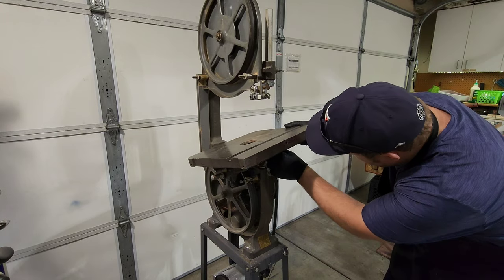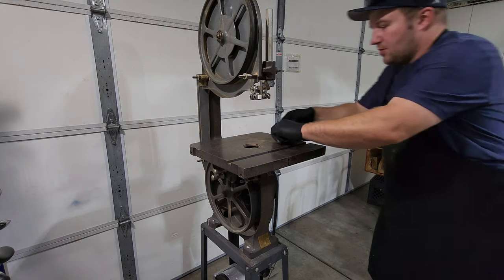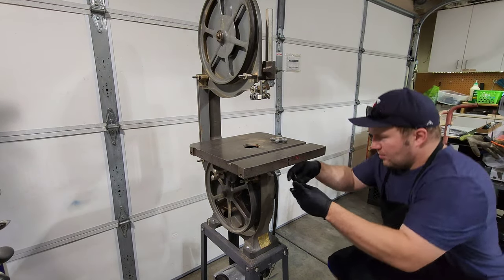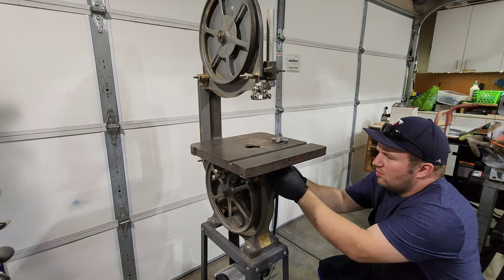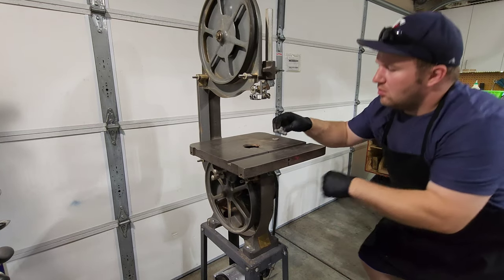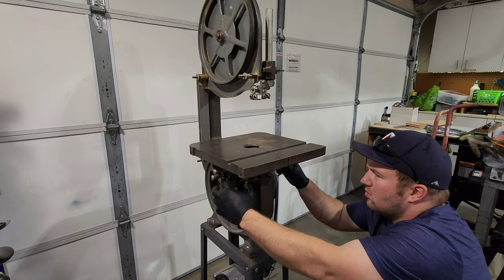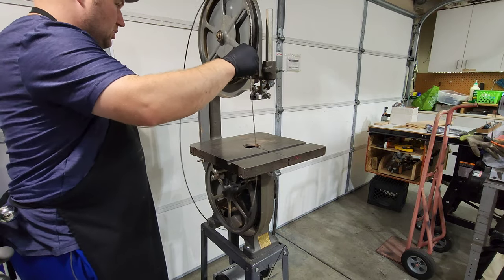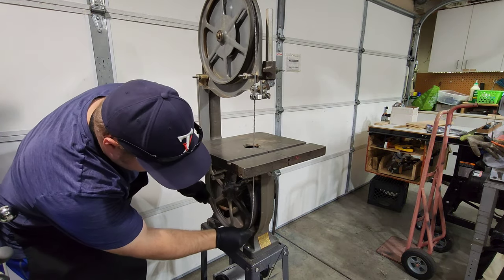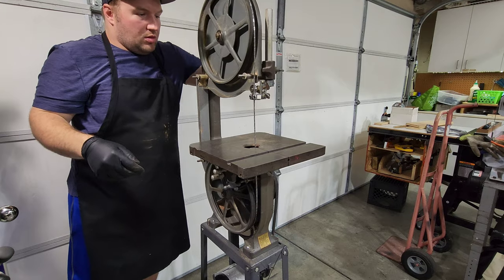Right here we're installing the table, so you've got to make sure the two bolts go in the right holes. Then you have the hand nut handles that have a spring and a washer on them — make sure it goes washer, spring, and into the nut. We're going to tighten those on. This saw can cut up to a 45 degree angle as you tip the table to the front. There is a leveling nut on the back that holds the table when you put it back down at 90 degrees, or whatever you set that nut at. A little further in this video we're going to talk about how to make sure that table is at a perfect 90 degree angle to the blade.